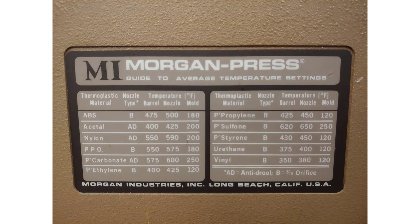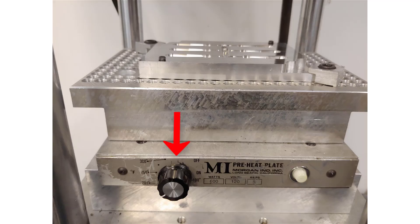There's a chart on the front of the machine with suggested temperature settings for different thermoplastics. The settings are a good starting point but may need to be modified based on the specific material being used. We will be using high impact nylon for our Geneva wheel handles — these settings are denoted by the red star. The mold preheat plate keeps the mold warm, preventing the thermoplastic from solidifying too early due to a large temperature differential. Here the mold preheater is set to 200 degrees Fahrenheit.